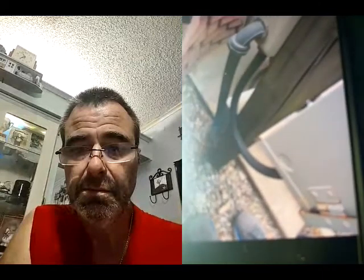Right below the timer, exactly directly below the timer, is the fuse or the breaker box. So this line that's going from the white box to the tan box of the timer, the timer goes straight to the white box, which is the salt cell box. And then the breaker from below gives the power to the timer box. Correct. And then I have one more picture. This other picture I'm about to show you is on the other side of the timer box, and that line right there that's coming out of the timer box goes straight to the motor.